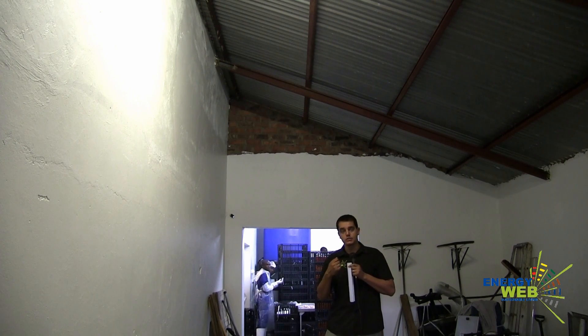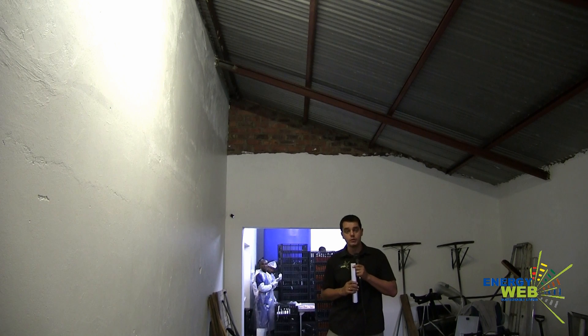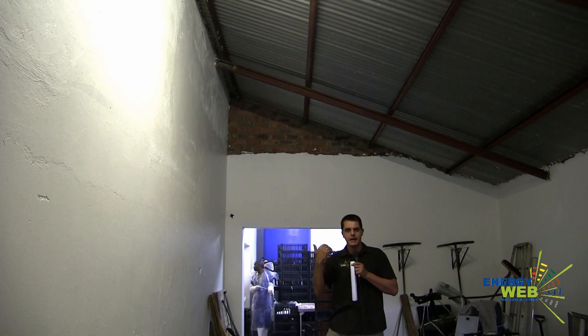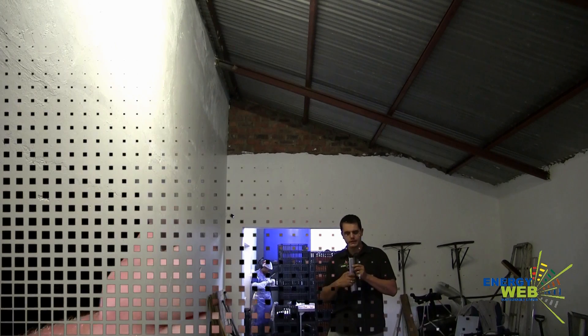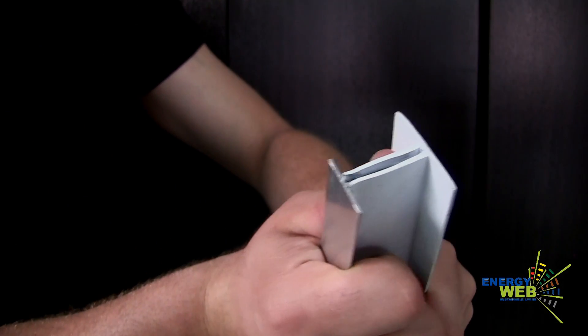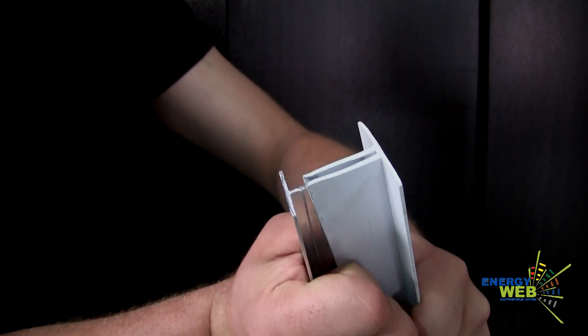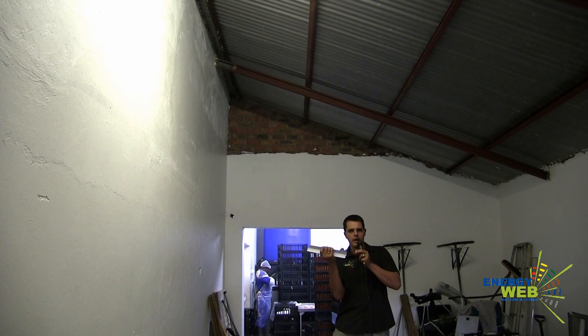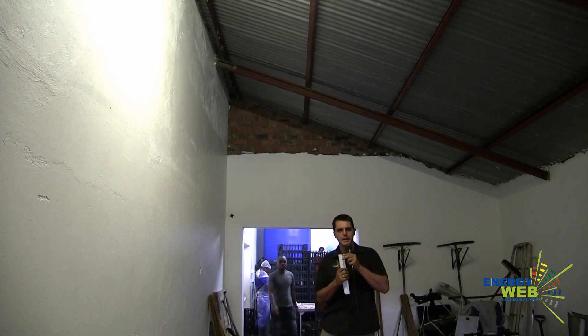What we'll be doing here today is installing rigid polystyrene boards. It's a nice and easy process but extremely effective with its insulation properties. It's a nice thick 40 millimeter insulation, so it'll stop all that radiant heat that comes in from the corrugated sheeting. The way that we do it is a male-female system — we install the male clip against the purlins, position the board, and then the female clip literally just pushes in and holds the boards in place.